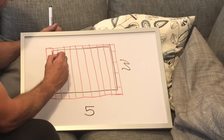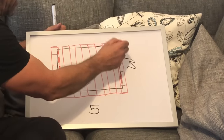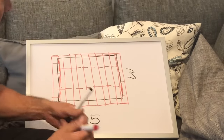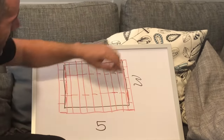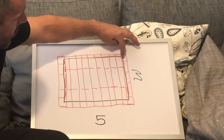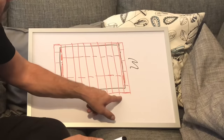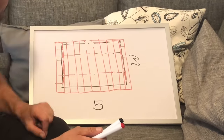I'll also put some timbers down there to support the noggins and fix the timber to the wall — same on the other side — and then put a series of noggins right down the building. That'll be your basic roof structure. We've got 300mm overhang on the front where the black soffit sits, 100mm soffit around the back and sides. The front wall is 75mm higher than the back so the water runs off that way.